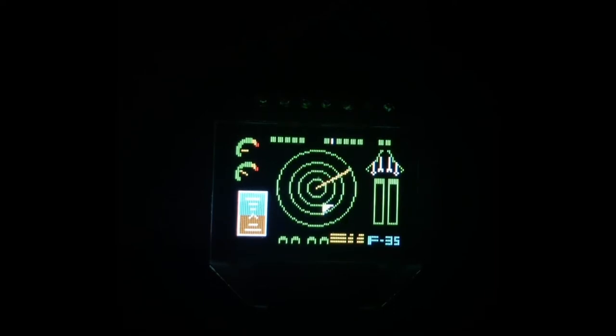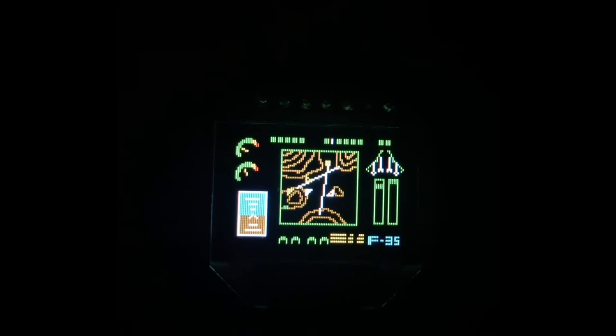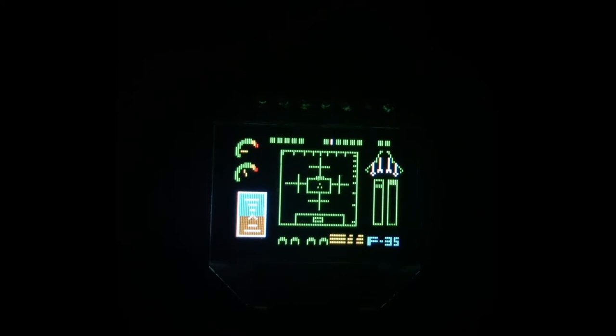From here we're going to transition to an active radar with a sweep that has pings. It moves around — we're using three radar arms for higher visibility in a cockpit rather than one. What we're really going to display here is the voltage indicators, which are simulated fuel. On the right-hand two columns we're going to actuate those down into about the 3.8 volt range so you can see the transition to yellow. There's also a FLIR screen popping up randomly, with a variety of FLIR targets that pop in and out randomly for variety.